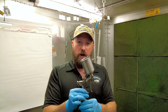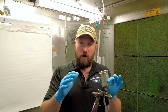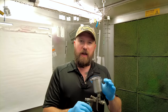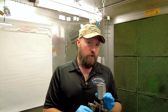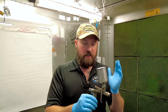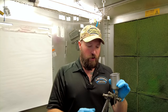We use the Iwata LPH-80s, and you need to understand that your gun may not be the same — your settings could not be the exact same as ours. I went down the path to become a certified Cerakote applicator and, after looking at adding this to my business years ago, I followed Cerakote's recommendation. They've been recommending the Iwata LPH-80 with a 0.8 spray tip since we started. I'd recommend you jump into that sooner than later to up your game.